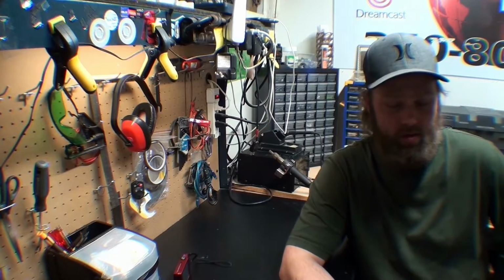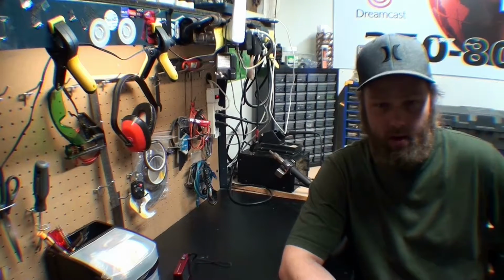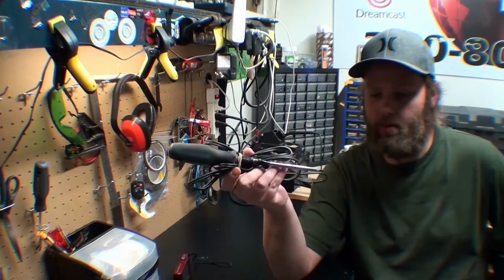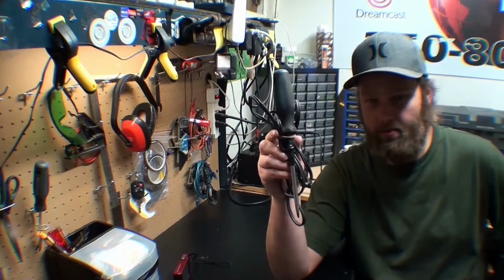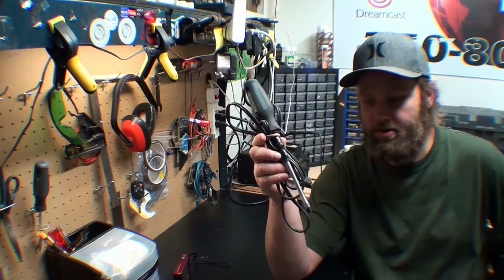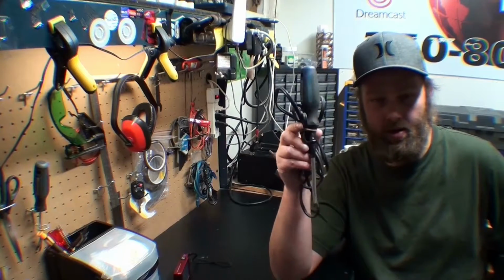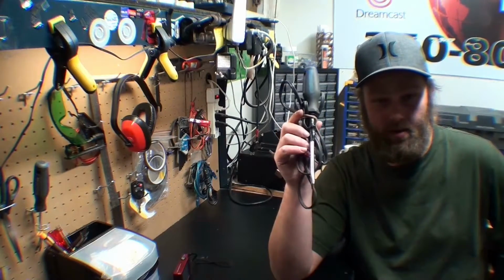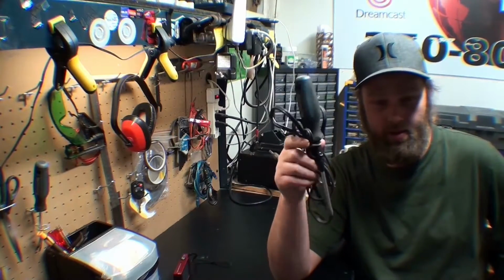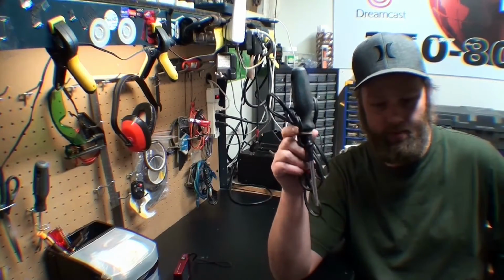Or if you need to feel 110% safe of what you're doing and that there's no harm that's going to come to you. For example, this guy here I use for removing yokes on monitors, so that way I can discharge the monitor, so I'm not going to electrocute myself, which is a huge amount of electricity. And when dealing with stuff like that, be very, very careful, because that is the only time I've ever shocked myself, and it wasn't from the yoke, it was from the flyback.